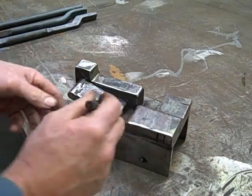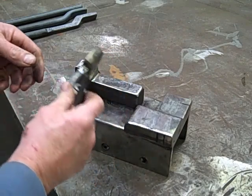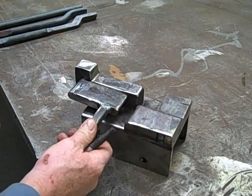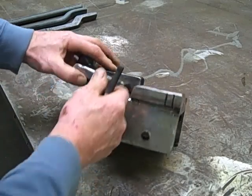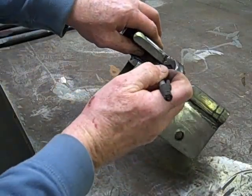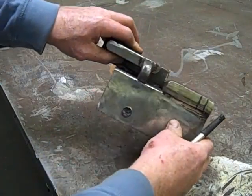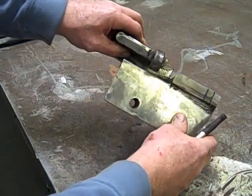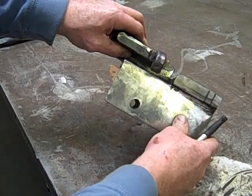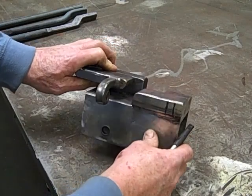Explaining this a little bit: this top piece is simply a kiss block. The arm here is going to designate our offset, and if you look closely at this, there's 5 eighths of an inch between the bottom and this arm. So this die was actually designed to be used with either 5 eighths inch round, 5 eighths square, or 3 quarter inch round. Any other sizes don't seem to work quite as well.